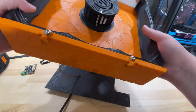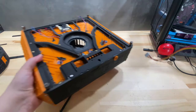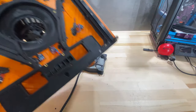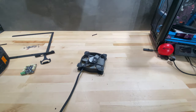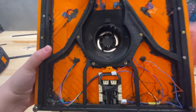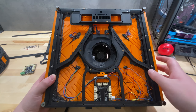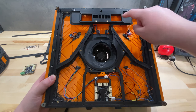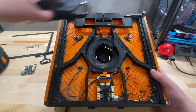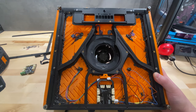I'll remove the active carbon to make this easier to show. This is the hub — the fan is not in here, it's in the back side. This panel is normally screwed in place, but I removed it to show how this works. The fan normally sits here and is screwed onto the back panel — which I didn't print with enough top layers so you can see the infill. The airflow direction is reversed in Nevermore Max v2 versus v1: the air gets pulled in through these cutouts.